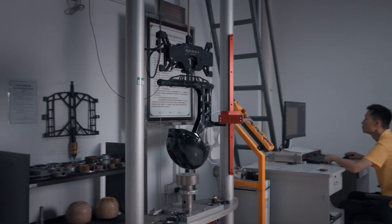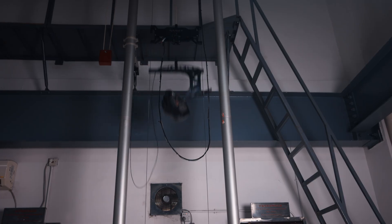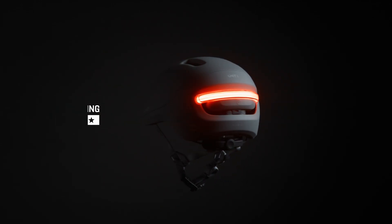This is not technically part of the production process, but we wanted to stop here because it's a big deal. This is the impact safety certification facility, where we test our helmets for safety. We tie the helmets up to this machine, yank them up, and drop them against steel anvils. Inside that fake head lie accelerometers and sensors that measure acceleration during the impact. We plug those numbers into a computer to tell us how safe the helmet is and how well it's doing its job. That's what goes into making a best-in-class smart helmet.